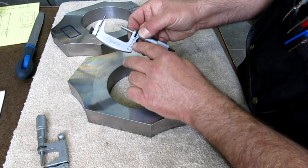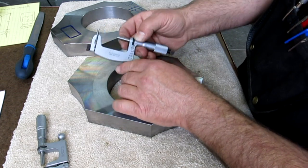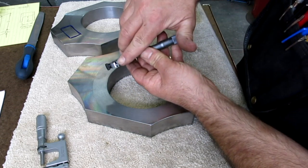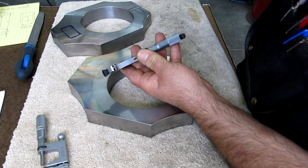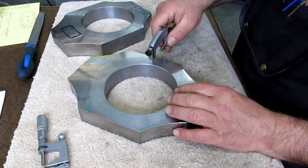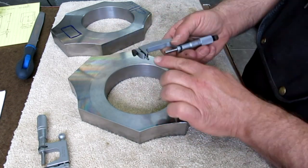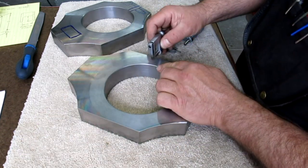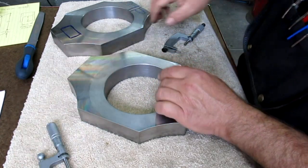The company that was selling this engraved the hell out of it, but that's okay — engraving kind of tells the history of the tool. There's also a round anvil tip you can put in. In this situation, that's great because we've got round against round. It's a smaller radius so we get good registration. With a flat, it's going to touch in two points and you won't really be able to tell where you are very well.